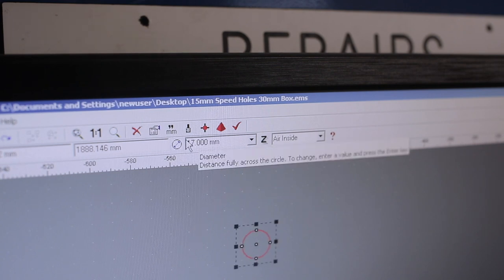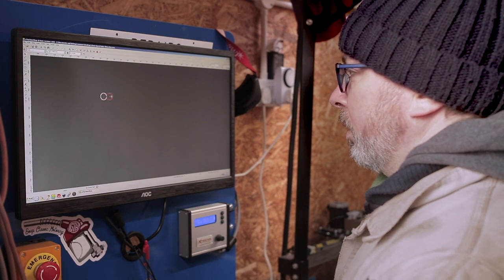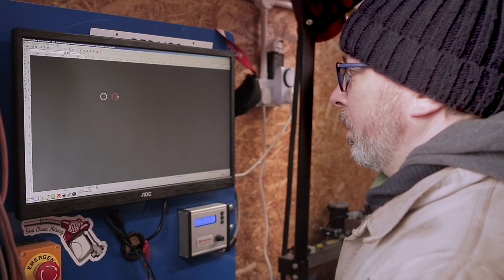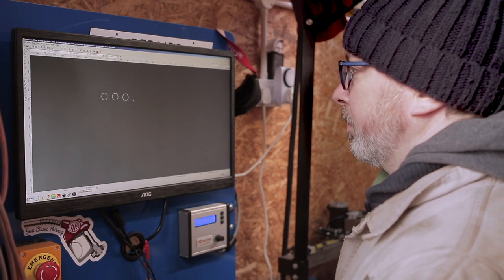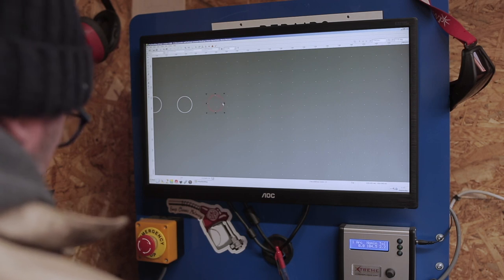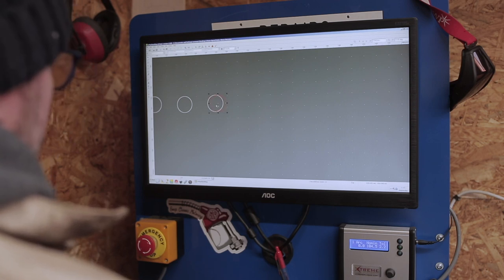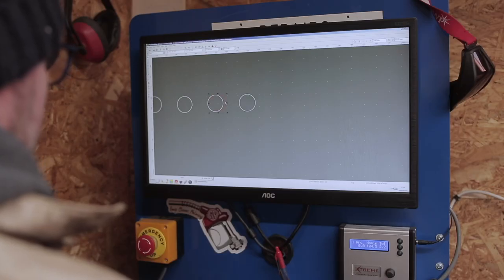These are 17mm holes on 30mm hole centers, and yeah, 17 seems like an odd number, but I started with 15mm holes, and cutting with an inside offset and allowing for a cut thickness of 2mm, 17 is where I ended up. Are you with me? The plasma cutter, at least the way I have it set up, can't help but lose 2mm to the thickness of the cut. Anyway, I just eyeballed the sizes, and 17mm didn't seem like it would take too much meat out of the box section tube.